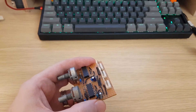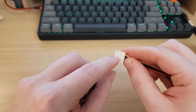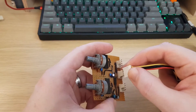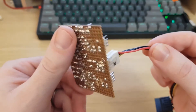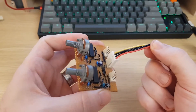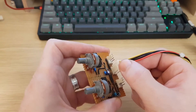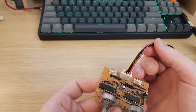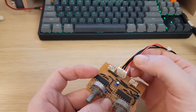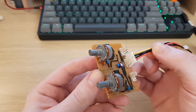What I figured a while ago was that if you take a floppy connector from an old power supply — they look like this — it has a little notch on the back. If you cut off that notch, it fits perfectly onto one of these headers. It has the same 2.54mm pitch and it's actually a really nice, tight fit. These pins are capable of taking about 4 amps. Maybe don't run it for a long period of time at that current. And a reminder that the circuit itself is not handling high current — it's all on 5 volts, and the output to the fans is a square wave with a maximum value of 5 volts.